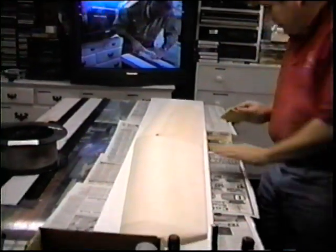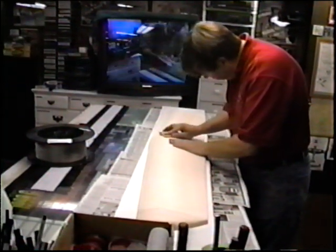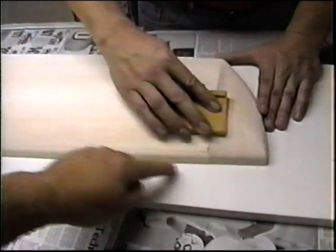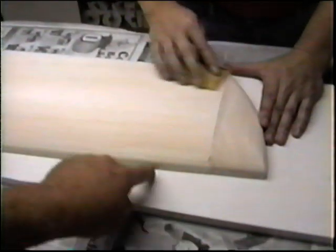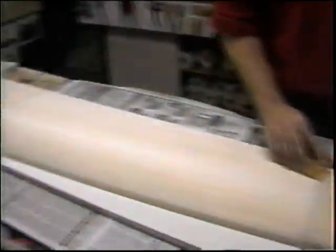This is gorgeous. When we're all done, let's vacuum. Yeah, it's going to be nice. Let's vacuum it off. If this blend down here goes down underneath, you've got to get a tiny little radius of fiberglass material, resin, anything, so you don't have an undercut. When you don't undercut it and tear it up. Yeah, it's going to be nice. It'll be a good one.